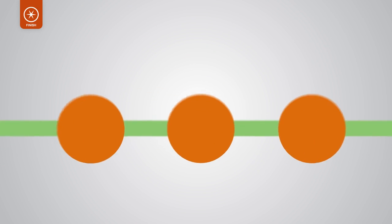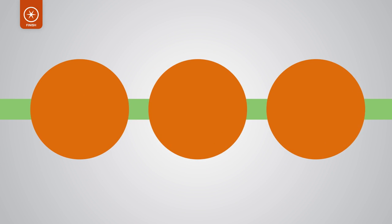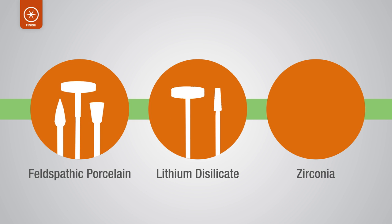This is important not just to provide the ultimate finish, but it helps to reduce the probability of micro-cracks and fractures, as a ripple-polished surface can be more conducive to micro-fractures than a perfectly blended smooth surface. Most systems for handling these different ceramics have been specific to each ceramic, meaning you had to have a multiplicity of different types of grinders and polishers relative to the type of ceramic you were dealing with.